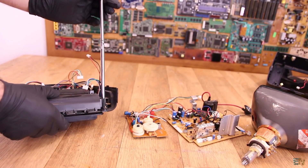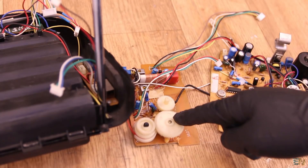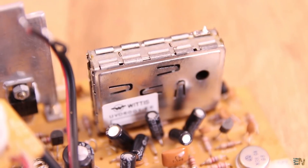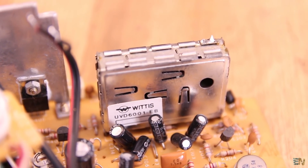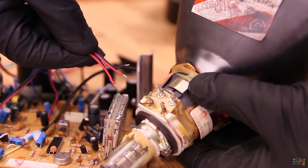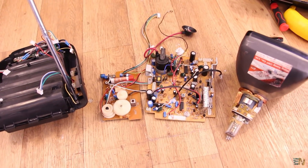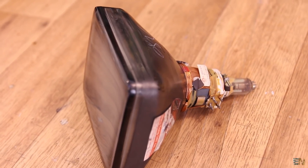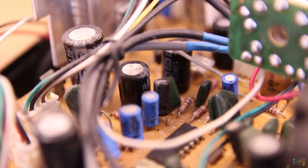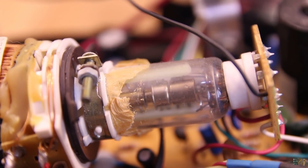The signal is received by this antenna, which is connected to this PCB. We amplify this signal and filter it with the frequency selector. Then we demodulate the sound and video, and that gives us the signal for the X and Y axis of the screen. Using these four wires, we apply that signal to the coils of the tube. Using the flyback transformer and the electron lamp, we create and shoot electrons. The coils deflect the trajectory of each electron and create the picture. As you can see, compared with any other digital TV, the circuit is very simple — just a bunch of passive components, some filters, a demodulator and the electron tube.